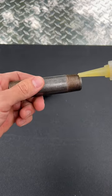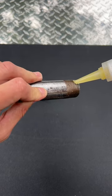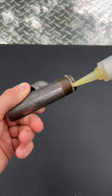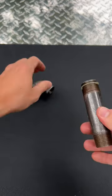Here we have a three quarter inch nipple. We're going to show you just how easy the pipe vice thread sealant applies. Just take a nice clean 360 degree bead and run that around the leading edges of the male threads. No need to smear this all over — a little bit goes a long way. Super nice and clean.